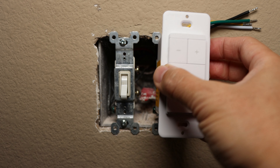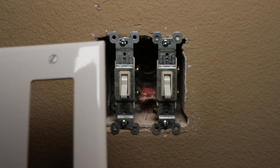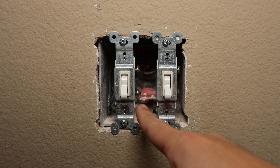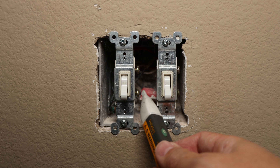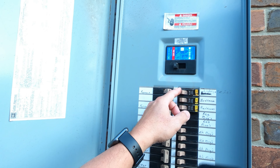I'll be able to install this on this box and will need a new wall plate with a combo decorator and toggle opening, which you can easily find at your local big box hardware store. On the fan switch on the left side, you will see it is connected to two wires. With a tester, you want to know which one is the line or hot wire — the top wire is the main line, remember that. Then time to turn off the breakers, which I used one of my Eufy battery cameras as a live monitor to make sure I turned off the right breaker.